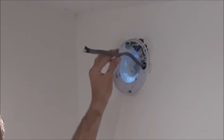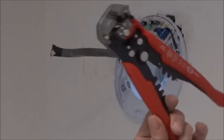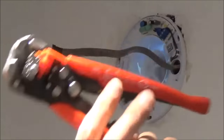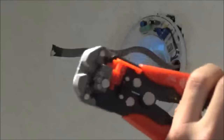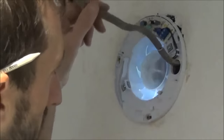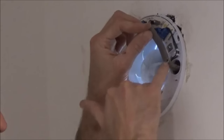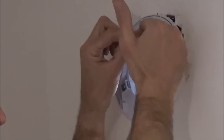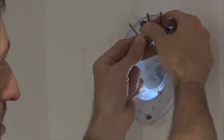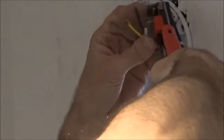The fan is secured and fitted to the wall; now I'm going to wire it up. Starting by stripping the cable using CK wire strippers — strip the outer sheath and get a rough length from the edge of the grey sheath that will reach just up to the connector block. Using the CK wire strippers again, take a little bit off each individual cable.